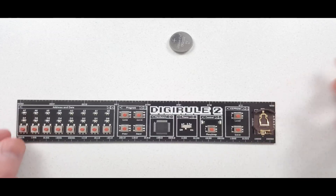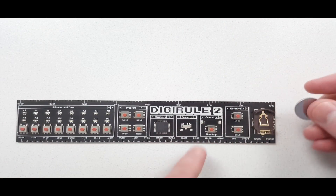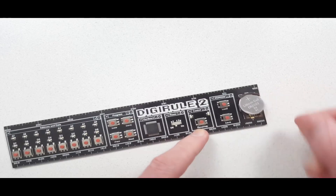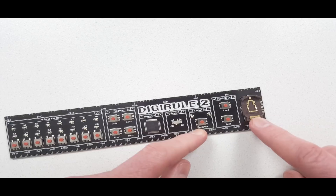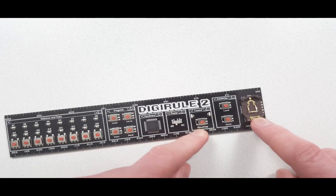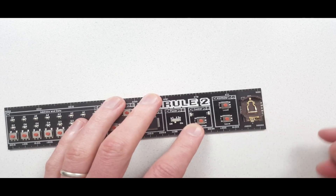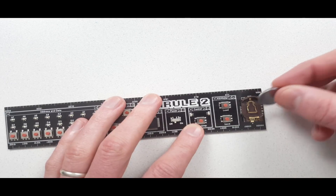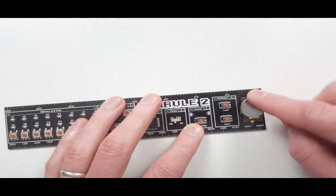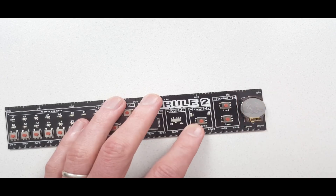Something that's quite important: when you go to put the CR2032 battery in, don't put it under the plastic tabs and then push down, because if you do that you'll most certainly break the metal tab here which forms part of the electrical circuit for the battery. What you need to do is put it under the metal tab first, then push down, and you won't break it off.